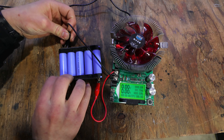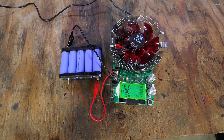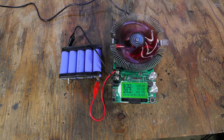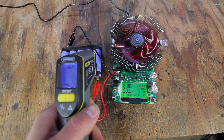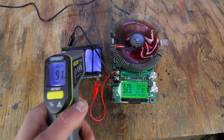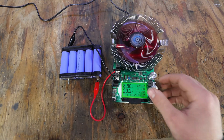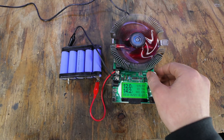For example, if we hook up a little battery pack to an electronic load and set it up to suck out a constant 20 amps, we can not only see the voltage drop like crazy, but most importantly all the cells are starting to heat up. It becomes so hot in fact that I have to stop the test before it sets my house on fire.